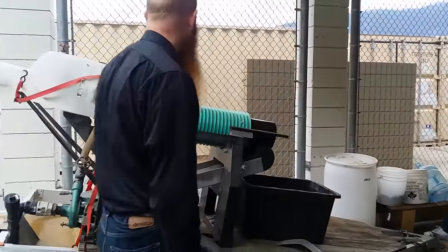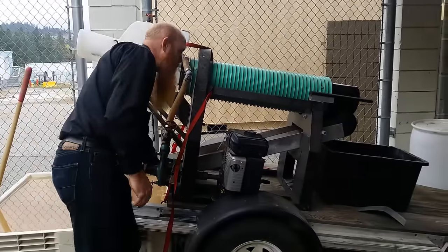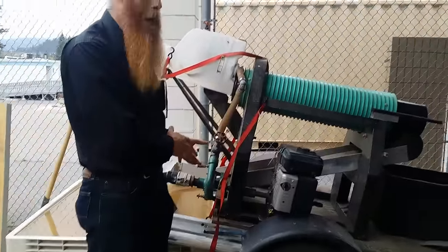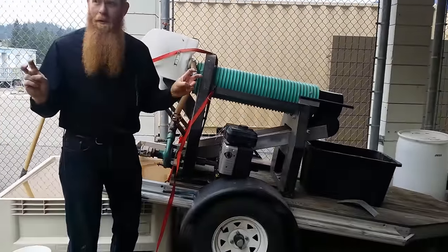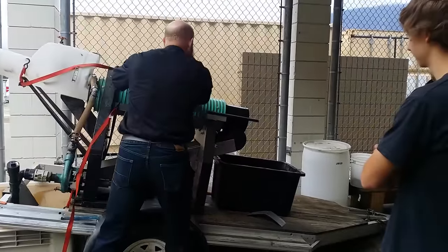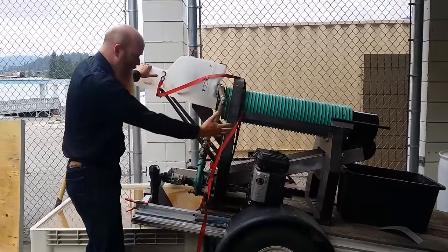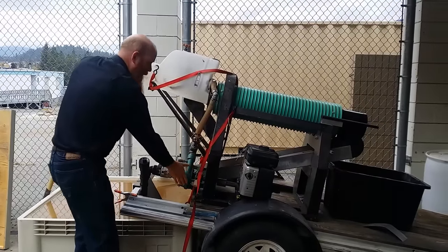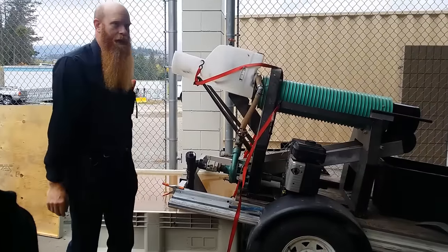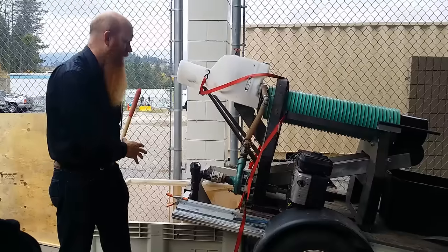The rest of the machine, there's the sluice down below that all the material falls into with the water, and the sluice actually catches the gold. So when you talk about a trommel, most people mean the whole machine, but in essence, just the tube is the trommel. Trommel, sluice, hopper, the engine for running the thing, and the water pump, which on this one is attached right to the whole thing. We've got it recirculating in one of the big bins. Typically, if you're out in the field, you would just have this dumping into a big settling pond.